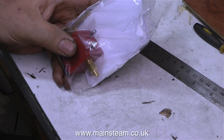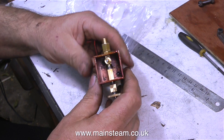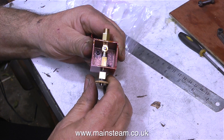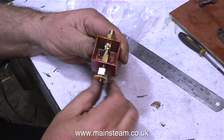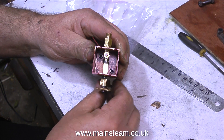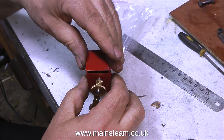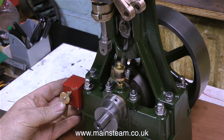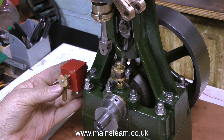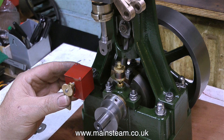As some time needs to elapse now before the Loctite is fully set, I thought I'd show you this. When I was up at Black Gates I bought this, and I'm really impressed with it. It's a mechanical lubricator of a slightly different design to the ones I'm used to. The ratchet and spring type are notoriously unreliable — though the one on my locomotive that I run round the garden has been reliable. This design doesn't use the ratchet and pawl type of movement — and that's pawl spelt P-A-W-L, not Paul as in Paul Simon. I also like the creative use of two rivets in the corners to hold the top piece in position. I will be painting this lubricator green to match the engine. I think it's going to go at the front, at the side of the eccentrics, and it's going to be the eccentrics that drive the arm. When I do fit it, I'll make a fancy bracket so it hangs off one of the bolts, because I don't want to drill any holes in the sole plate.